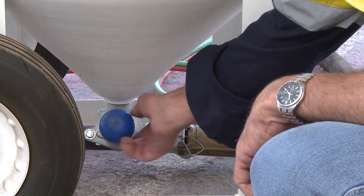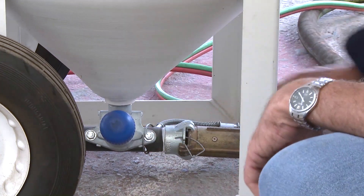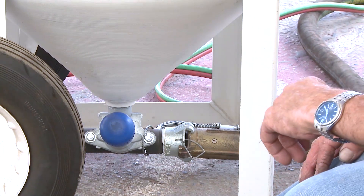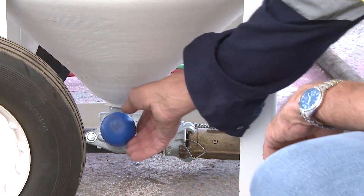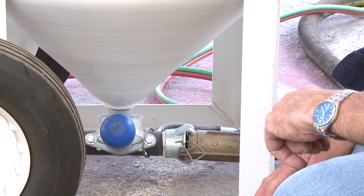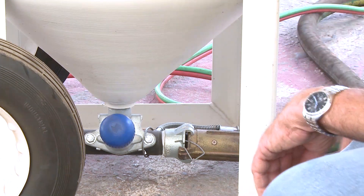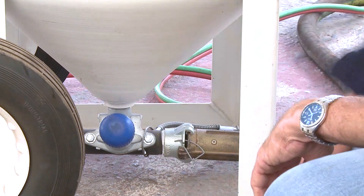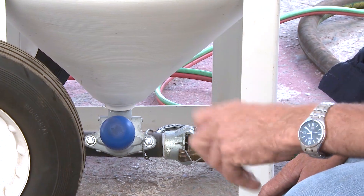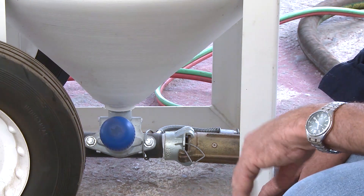The micro valve, what it does is by adjusting that valve, it enables the flow of grit to enter into this pusher line, air line arrangement and into your blast hose. You've got to remember that you can actually flood the blast hose with grit if you open that valve too much. So therefore you impede the blast, you're wasting grit and you're not achieving the profile that you're looking for. So less is more in this case.